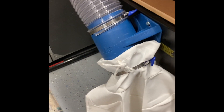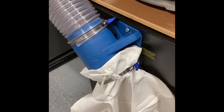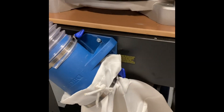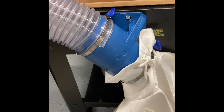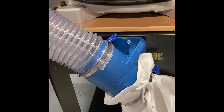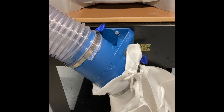Moving up, we have a coupler — this is a Rockler Dustrite coupler. Again, Rockler is not a sponsor. The coupling is mounted on the side of the cabinet at an angle. That angle ensures fewer bends in your dust collection system, which is better, and this provides a really good angle.